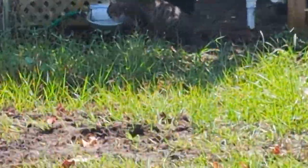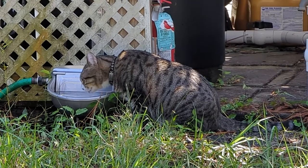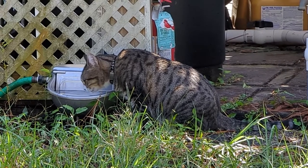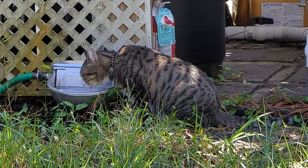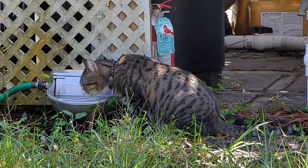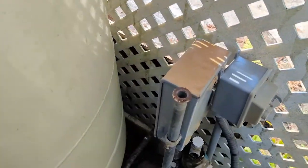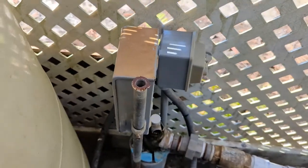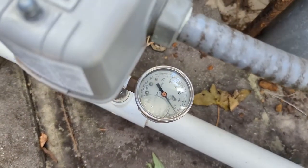Good to know — Thor actually uses the water out here. I just rinsed it out and got all the gunk out of it, so it's nice and cool. That's awesome to know he's got good clean water out here. And since I fixed the well it can replenish itself again. I went over to Grainger's, paid full price, got the box, put it back together — that's the cover with the capacitor and relay. We've now built up pressure again, so we are all good.